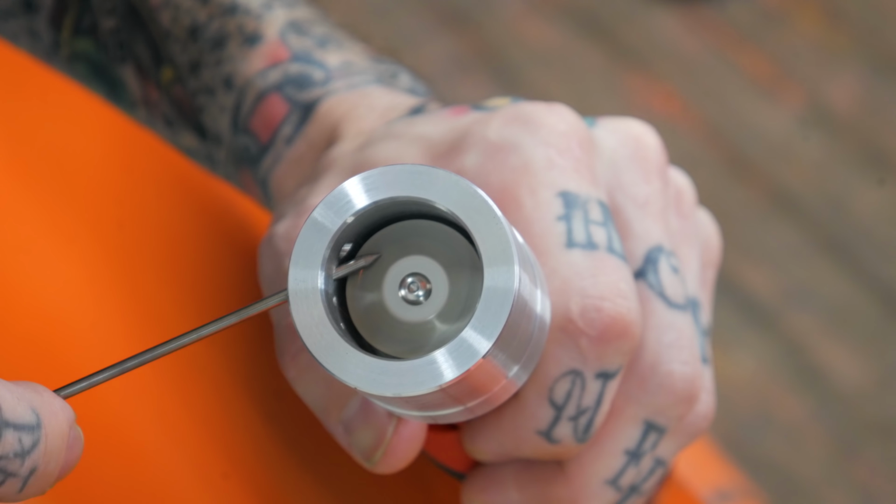When you break the tungsten, you actually microfracture it up the shaft of the tungsten. So now you have the chance of arc wander coming off the side of that tungsten along those cracks, or the tungsten straight up failing and falling apart under load. You're never ever supposed to break tungsten. You should only cut it off.